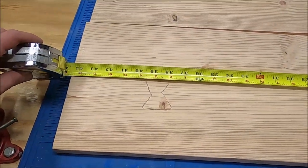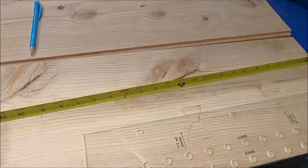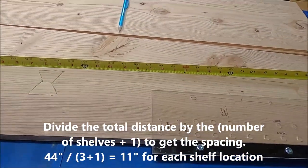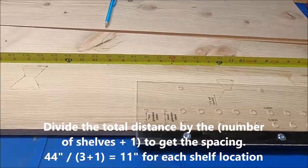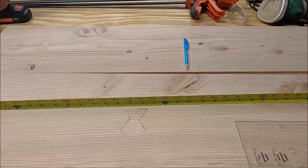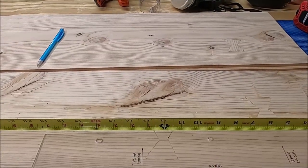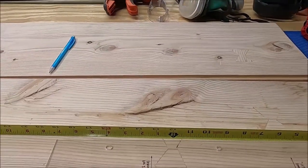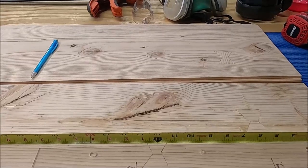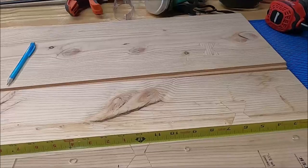The inside of our board is almost 44 inches, so if we want three shelves we add one — that's four — and that's the spacing to use for each shelf. So we have 11, 22, and 33 as where your three shelves are, evenly spaced. With adjustments, we'll drill close to the 9.5, 11, and 12-inch marks, and then do the same thing at 22 and 33, which gives you the flexibility to move the shelves to different heights as needed.